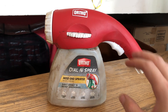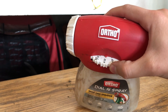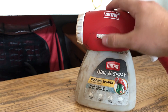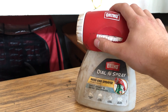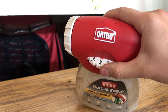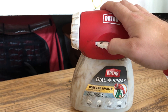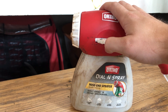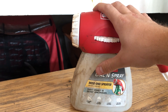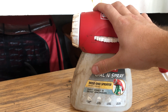On the dial you can choose how many ounces of the contents of the container are delivered per gallon — for example, three ounces per gallon or four ounces per gallon. So you have two gallons a minute and four ounces a gallon — that's going to give you eight ounces in one minute of time.